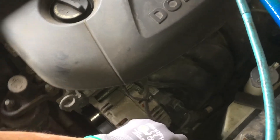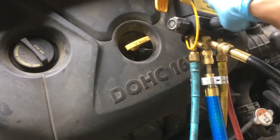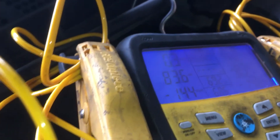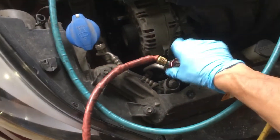Let's hook up our gauges and see what the pressures are, because I suspect there's next to nothing in here. Turn off the vacuum and open up the gauge — see what we get. And what do we got? Basically zero — 0.1 psi. We have nothing there. So we have an empty system.